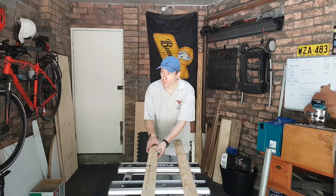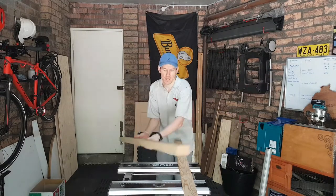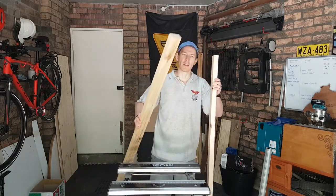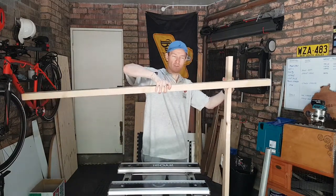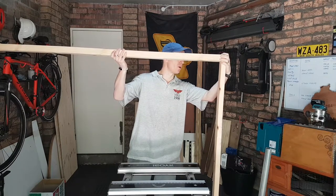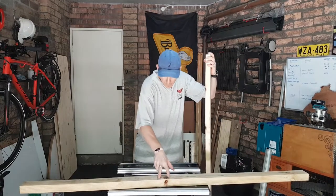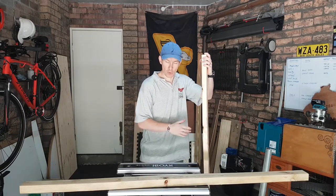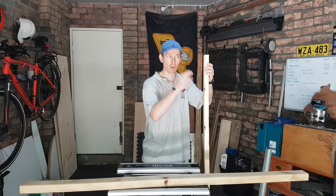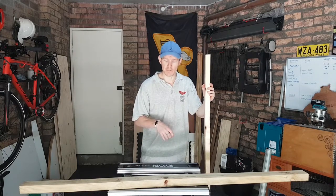I had an offcut from repairing the stairs at my sister's place - a 35mm piece of H3 - and the 45s I just bought will form the long cross supports. These will form the vertical supports. In cabinetry these are called stiles, and these are called rails - rails run horizontally like train tracks, that's how you remember it. I'm going to glue and screw those using my Kreg pocket hole jig, plus add a structural support in the middle. Dyna bolts on three sides will hold the frames in place - it should be quite a sturdy structure.